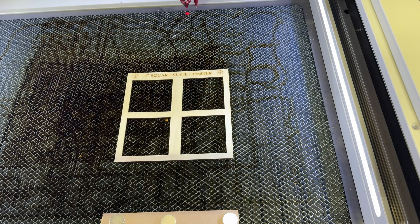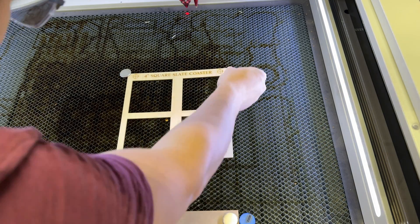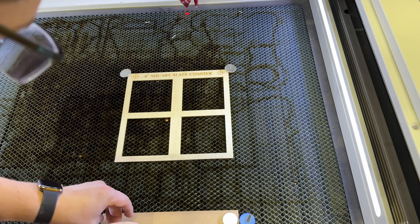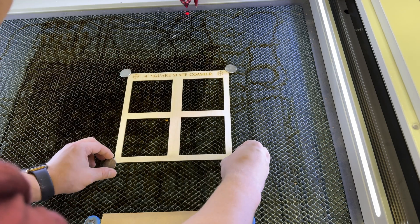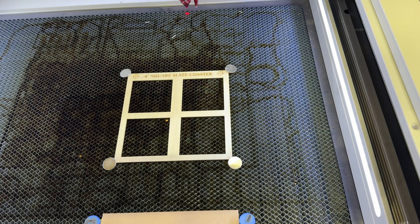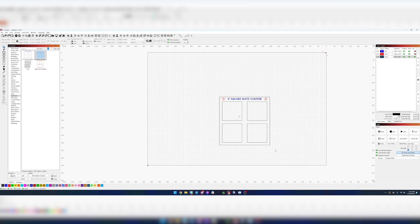Now this step requires a little bit of back and forth with Lightburn and with the laser. We're going to start by putting in the template, and I'm going to use some neodymium magnets to hold it down — one on each corner. This Baltic birch has a little bit of warp to it so we'll set it carefully. Now we're going to jump over to Lightburn: start by selecting everything and making it a tool layer, then group it so nothing moves independently. We'll change that in a minute.